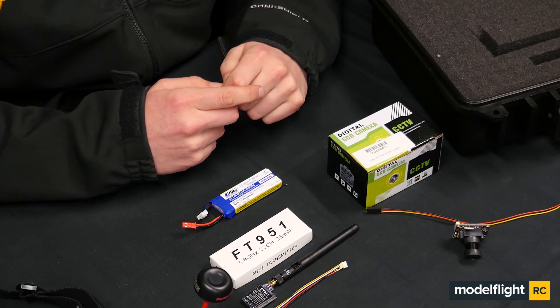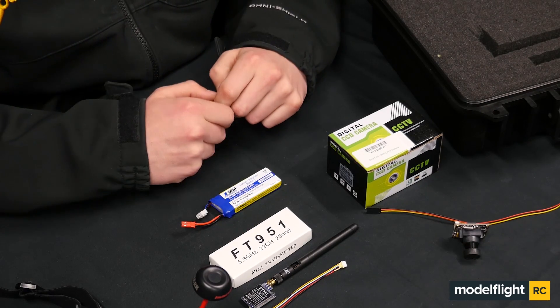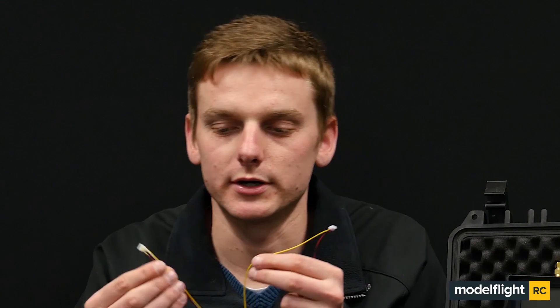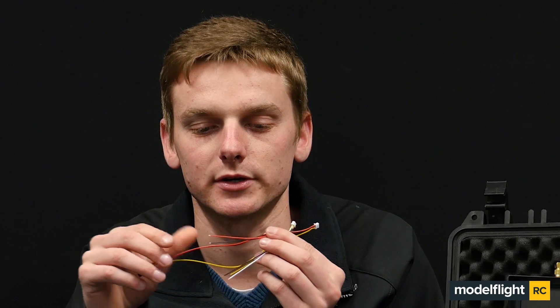For those who don't have a GoPro, we do have a Sony FPV ready camera available. For this you will need to make up an adapter wire to have it connect to our Helistar FPV transmitter. You'll need the wire that comes with the FPV transmitter and the wire that comes with the Sony camera. It includes a JR style, normal receiver plug. You'll have to cut this off and run the yellow wire to the yellow wire on the FPV transmitter cable, and then the black and red wires from both to a JST style connector.